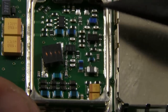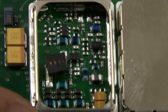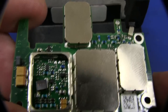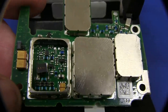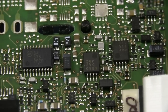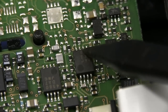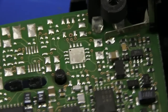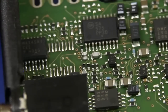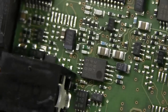The fourth can has some more basic stuff - a nice potted inductor with about four turns on it. It's most interesting that they've really gone to town here - belt and braces stuff in terms of separating and shielding each section. Very impressive. No surprises - the same SA575 compander chip we saw in the transmitter, you've got to have one in the receiver as well. There's another JRC jellybean op amp, and another JRC op amp, probably a TL062 equivalent. There are a couple of unpopulated devices on this board - so maybe there's another model variant. There's a MAX4581 analog switch. That's about all she wrote on this side.